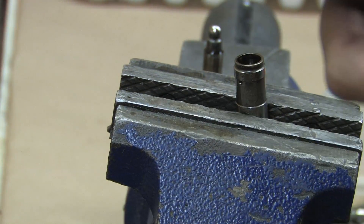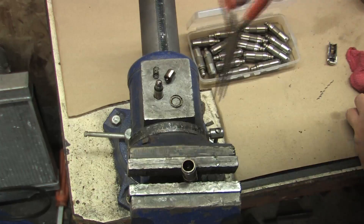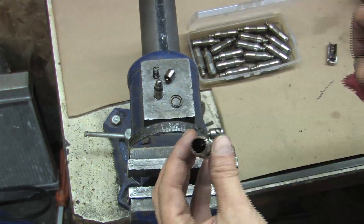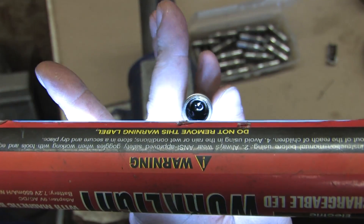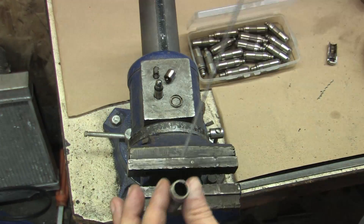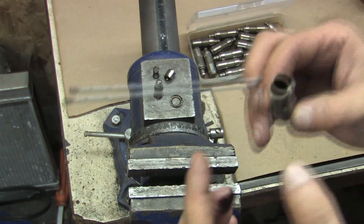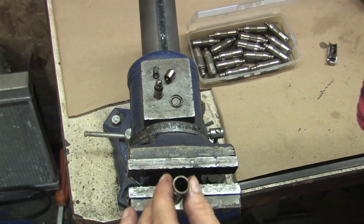Try not to mark up the upper piston because its oil clearance is extremely tight. Once you've got the lower piston out, there's a spring beneath it that you don't want to lose. Now it's easy to clean each part and reassemble them. Because the 1G oil exit is smaller than its fill hole, it permanently traps any trash that's ever fed from the oil supply. You can see a pasty black carbon goo in the bottom of it — it's not even slippery, in fact it's a little gritty. That sludge can build up and block the check valve.